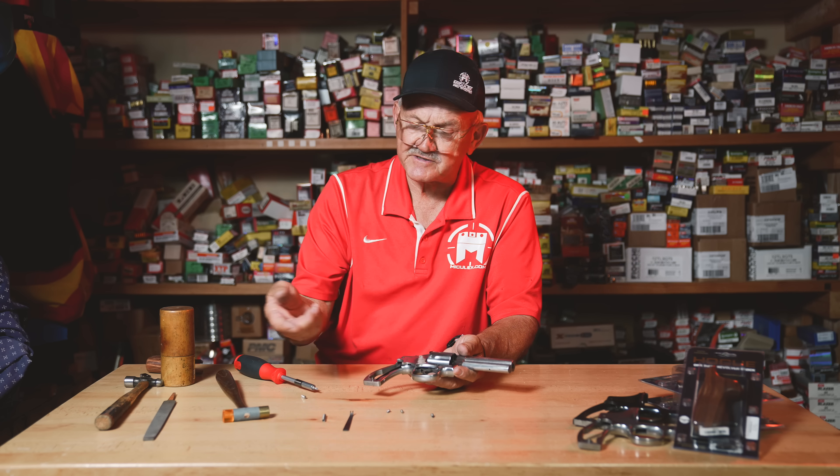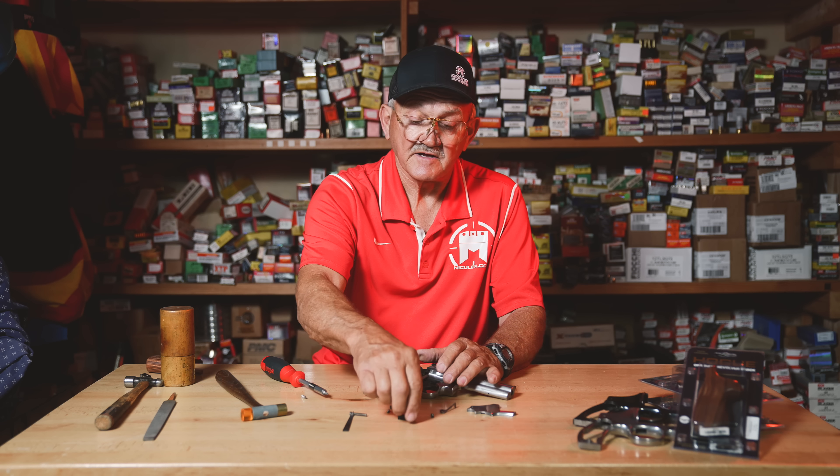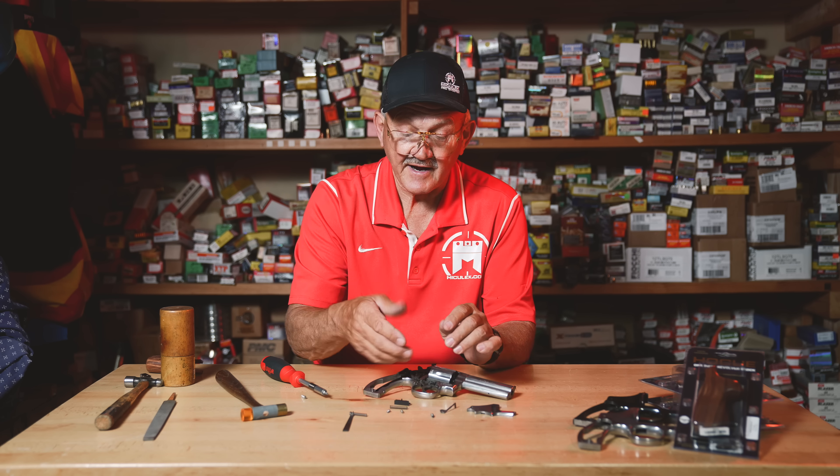There's a small safety piece that comes out. Next, I'm going to release the spring pressure on the trigger return mechanism. I recommend safety glasses — that spring is really under a lot of pressure. That's the spring we're going to replace; it pushes the trigger mechanism forward after you fire. You can take a screwdriver and pry up underneath the rebound bar and it comes right out. On some Smith & Wessons there's an over-travel adjustment rod in the slide assembly; this one does not have that.